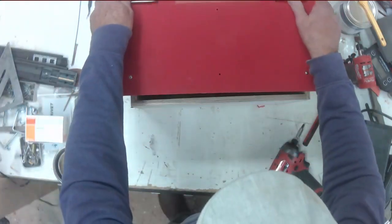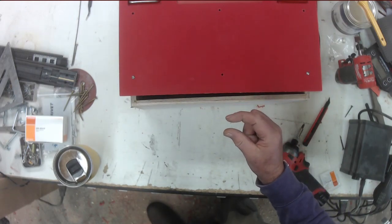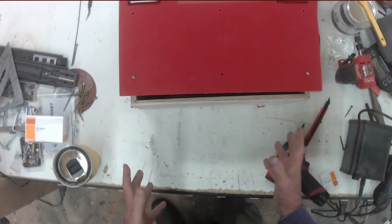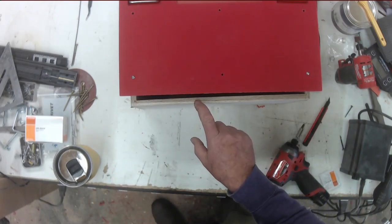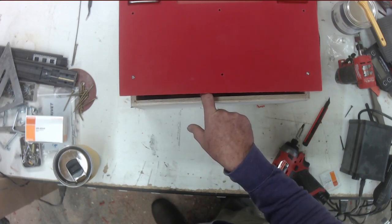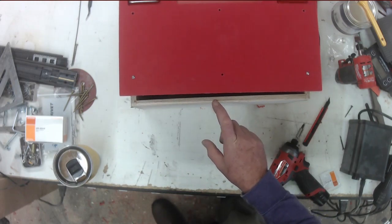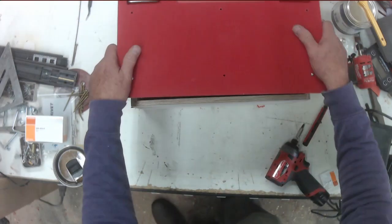And so I ordered a patterning bit, and it's a straight cutter on the end, but then above that straight cutter, it has a bearing on it. So what I can do is make a pattern of all the cutouts that I want to do in any of the sides of the drawers, and make a shallow cut in it. I'm thinking that I may cut it down where the bottom of the bit is just an eighth of an inch from the inside of the drawer. I don't think that I need to leave it any thicker than that. Maybe I'll go to 3/16. I don't know. But what it's going to do is just remove a whole lot of material out of the drawer itself. And I'll do that on the front.